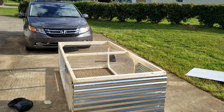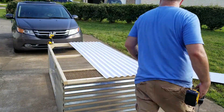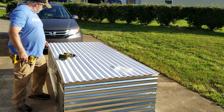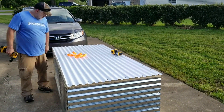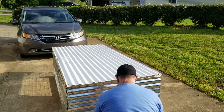Once I got back, I finished with the hinges and started on the polycarbonate roof. I drilled pilot holes for every screw because it's basically a plastic material and I didn't want it to crack. I used two 2x8 sheets overlapping to create a nice secure roof. To make it easier to move, I used some old tie-down strap material screwed into each end as handles — it worked well on the first tractor but tore the first time I tried to use it on this one. Leave a comment if you have any ideas on what kind of handles I should use.